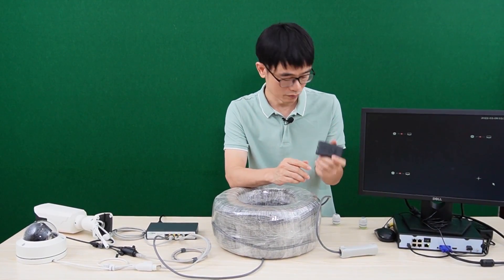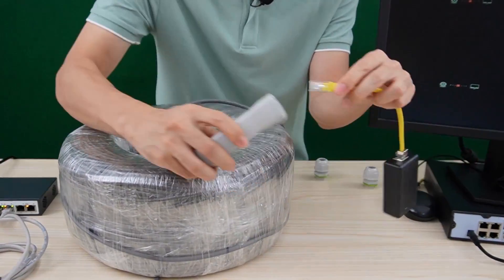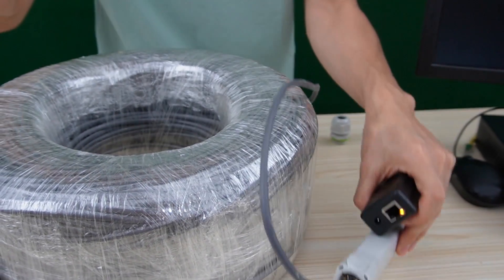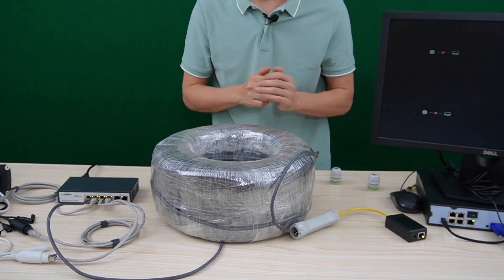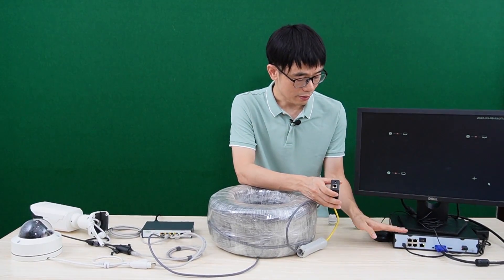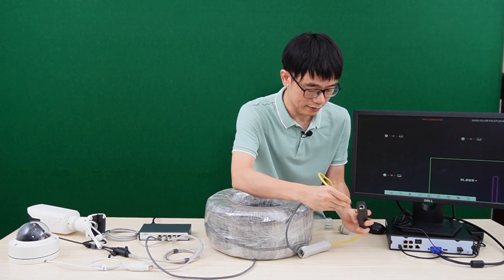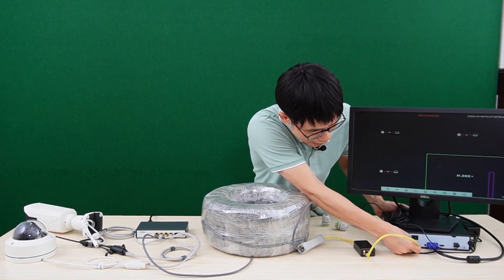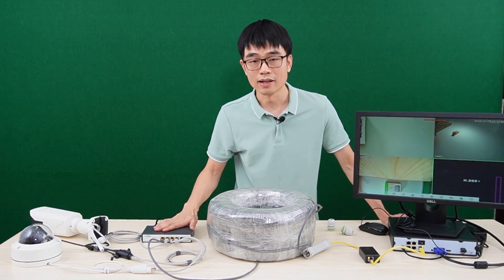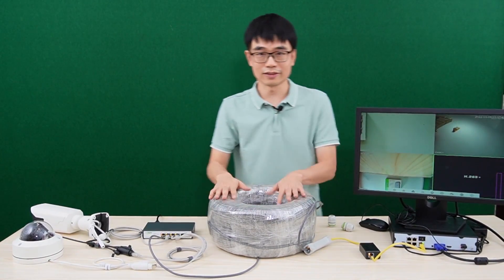So in this case, we still need this PoE splitter. Let me connect first and explain later. Connect the input port and connect to the output port. Once connected, you can see the indicators on — and here we also have indicators on. That means the whole PoE system is working. I can connect whatever IP device to this port — it could be the camera, the network video recorder, a PC computer, or an access point. Now let me get a short patch cord to link this data port to the uplink port of the network video recorder. We don't need any PoE port here because this splitter is now supplying the power for the cameras. Now I can see the cameras' live video — this is 1,000 feet.